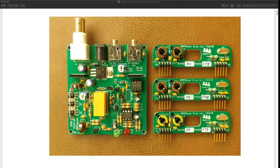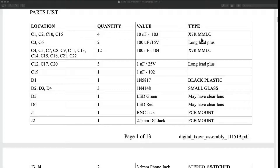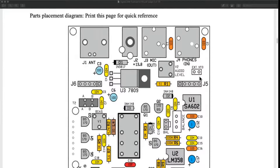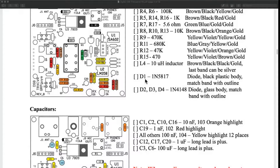All of the ports are on one side of the board, which is nice. If you've used a Raspberry Pi before, you've got cables going out every side of that board, which is annoying — so having the cables come out one side is really nice. You can switch between the 20-meter, 30-meter, and 40-meter bands. The crystals are 7, 10, and 14 MHz. The toroids on the 30 and 40 look about the same, but there are more turns on the 40 than the 30. There are also two more surprise toroids, a couple of transistors, what looks like a relay, a couple of ICs, output jacks, and a whole bunch of resistors and capacitors. There is a placement diagram and a checklist of parts and the suggested order to install them.